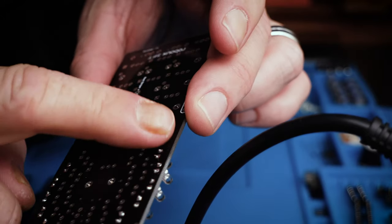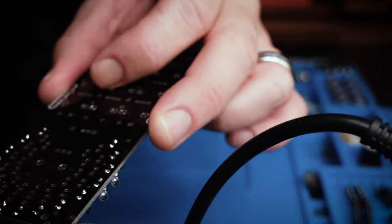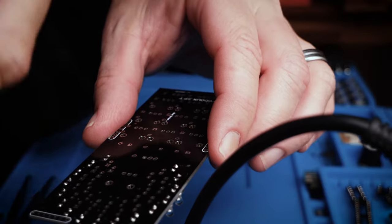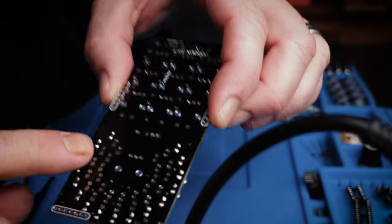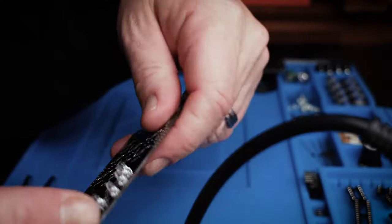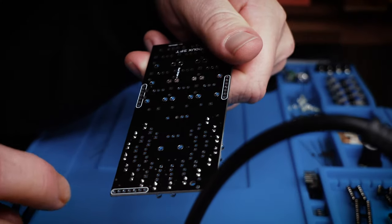And even with just that single row that I did, it kind of got at a couple points a little difficult to get in there with the solder because there's lots of legs poking up and kind of hitting you in the knuckles and stuff. So it's a little hard to get around. So yeah, my advice for what it's worth is just to do one ring at a time just to keep it under control because it's pretty tight in that area.